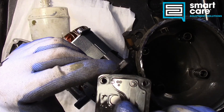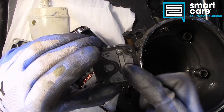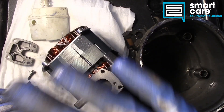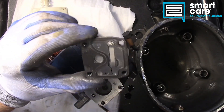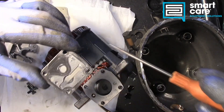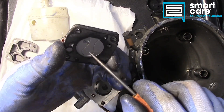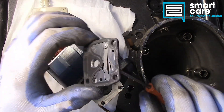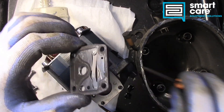Our valving here — you can see a spring steel valve that has a lot of flex to it. It sits against one port, and the other port in our valve plate has a valve going in the opposite direction. We have two phases of movement: a suction phase where the piston drops down and pulls in — that's the larger valve — and then as the piston reaches the bottom and starts coming up, it closes that valve against the plate and pushes compressed vapor up through the smaller valve, which is our outlet.